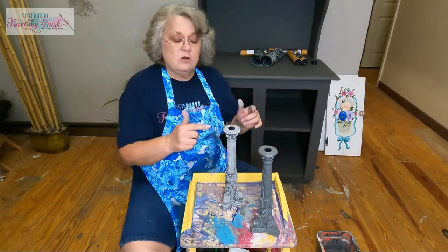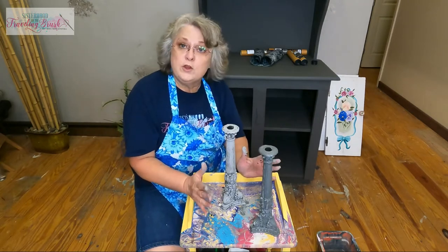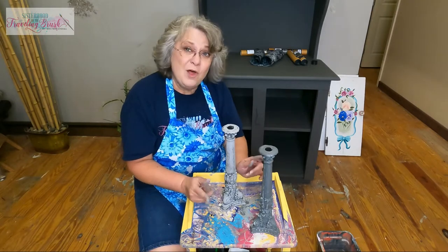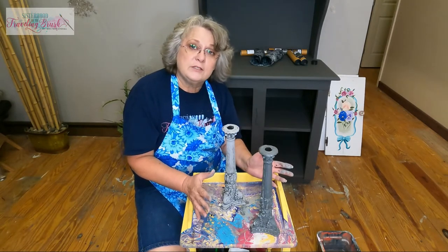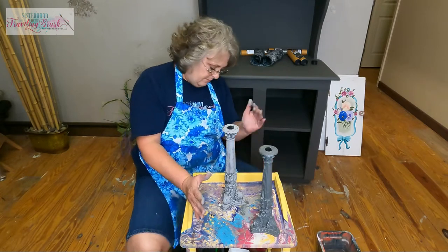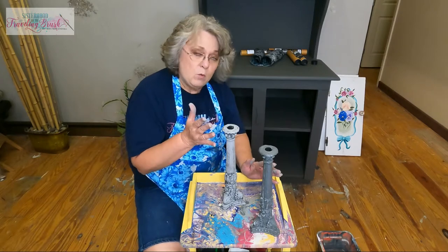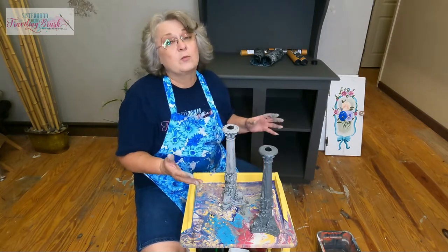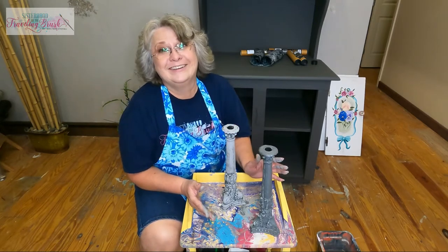Okay, here's the other tip I was fixing to share with you. Remember a second ago I told you how the DIY paint gets reactivated when you wet it. So if there would have been a drip, I could have just wiped it back off with a wet rag. It will also wipe off when we put another coat of water-based paint on there. So we have to be very careful when we start that process that we're applying paint on here, not taking paint off of here, because it can be really, I cried the first time it happened. I'm not gonna lie to you.